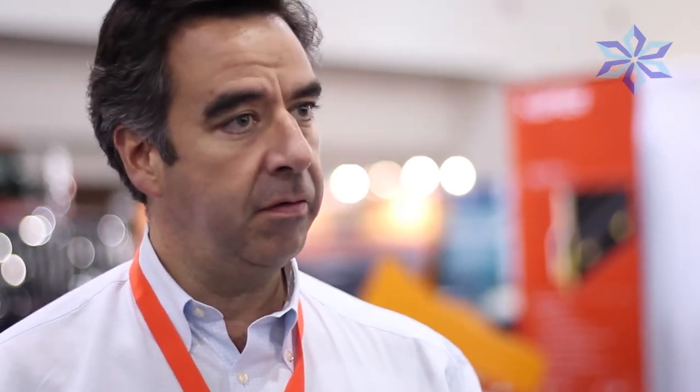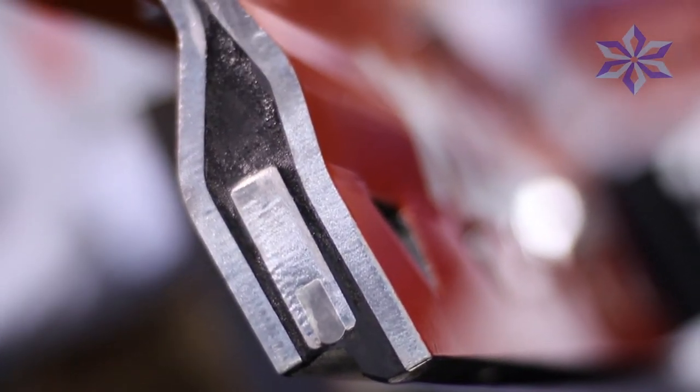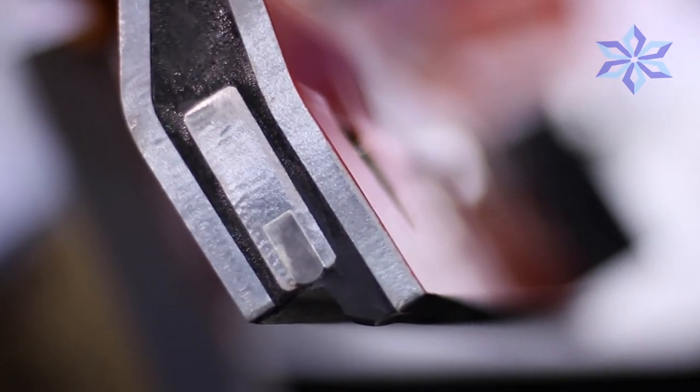We show here two primary products. We have a carbide product where the carbide holder sections are free-floating — they're vulcanized within the rubber — and we also take the extra step to vulcanize Hardox 400 plate front and rear. This gives the blade the ability to cut very well, cutting compacted snow and ice. It also helps when mounting the blades, since they come in standard size sections. You hang them, set your bolts, torque them and forget them — no face plates or other adjustments required.